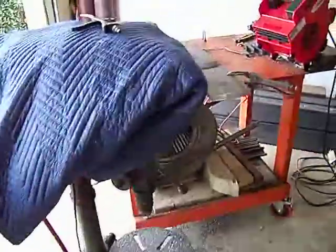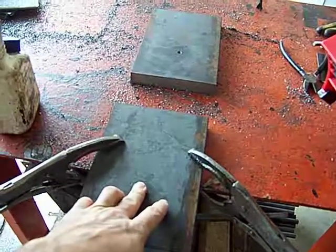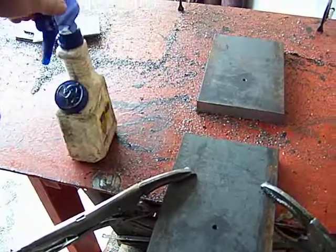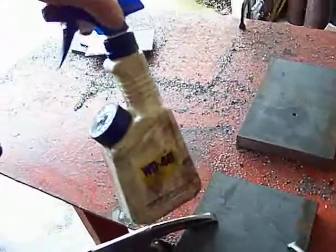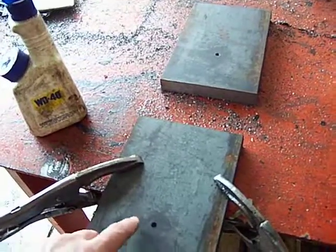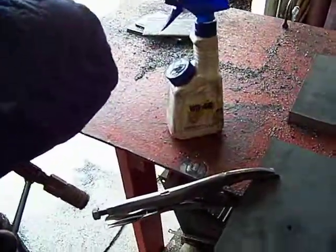It's going to get pretty loud. One thing I'm doing is running a fan to help cool everything off and keep the tip cool. I'm also applying WD-40 — and to be clear, that's not really lubricating it, it's keeping it cool. WD-40 works great; you can even use water as long as you're trying to keep it cool. That's the whole purpose of putting a cutting fluid on there, and the fan helps too. I'm using a cheap fan from Harbor Freight.